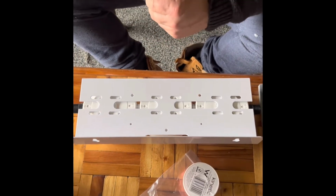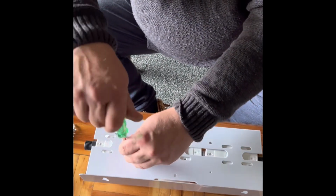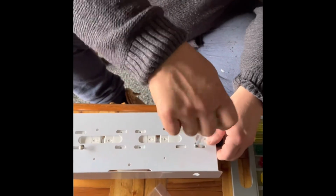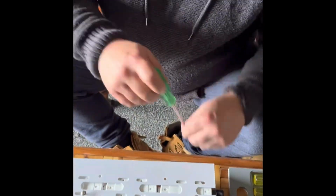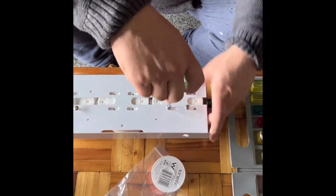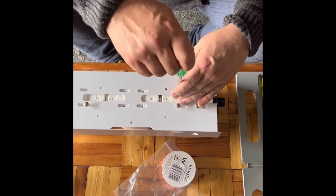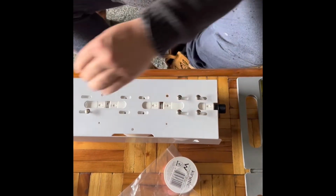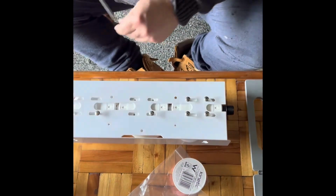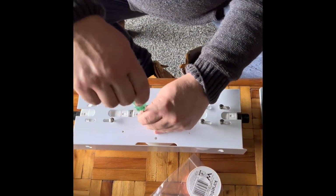So I'm just going to get this screwed up. So with our 3 filters in this part of the filtration system, the smaller the micron size, the finer the filtration, the greater reduction of the flow rate and available pressure through the filter as well. And surely they all fit in there nicely. You can also disinfect the water with chlorine, but it needs to be regularly tested, sometimes daily, to check whether it's safe in the drinking supply.